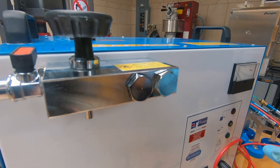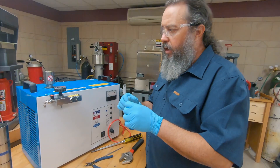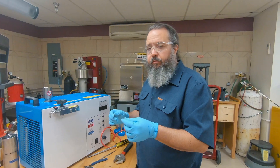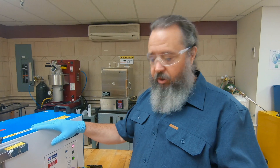That is the maintenance on this machine. You can replace your hoses and then you'll be back up and running. Now I'm going to cover a little bit of troubleshooting for the machine. The first thing we'll start off with is the check valve. Remember I mentioned the check valve — if you didn't run this machine for 10 minutes a week, that check valve could possibly become stuck.